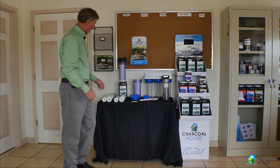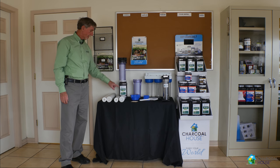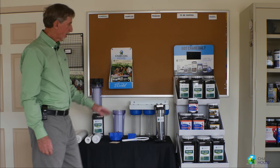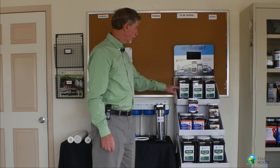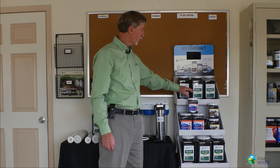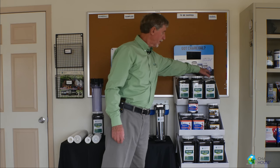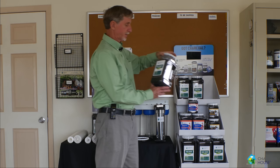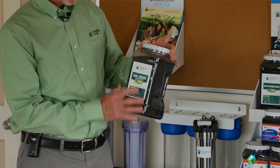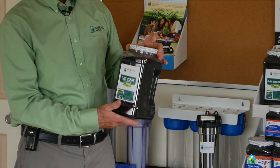In our applications, typically we'll use a granular activated charcoal with a 12-30 mesh size, but we have other different grades that we can use. We have bone char — this is an 8x16 which is quite common. This one over here is a 2050S, or there's another one called 2040CAT, and they are used to remove chloramine in the water.